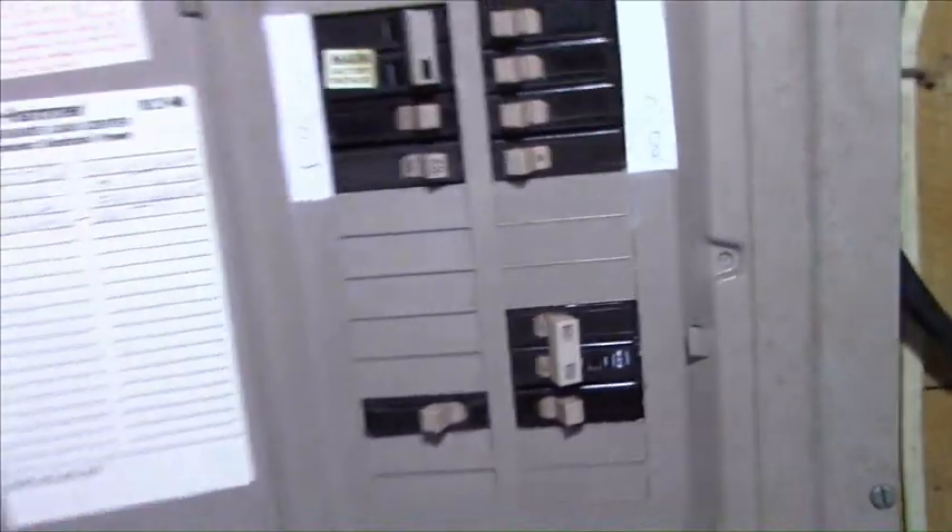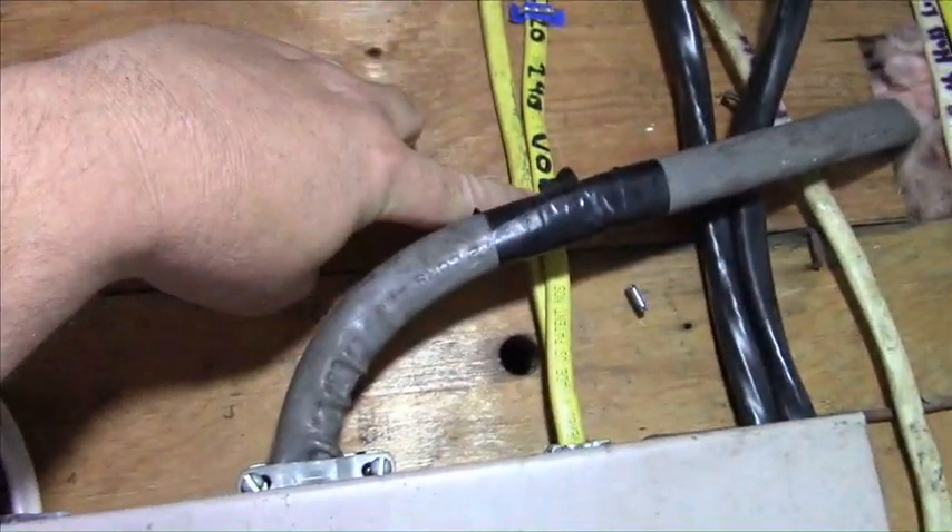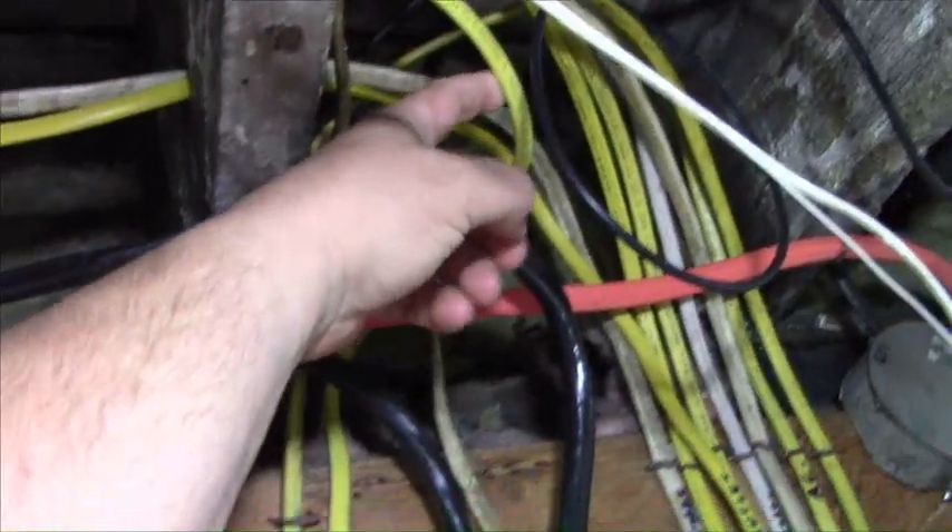Here's what I have in here. This is the Cutler Hammer CH panel. I have a 240 volt 20 amp breaker here, and it has its own wire that has been labeled '6-20 240 volt.' I ran this wire specifically for the 6-20 outlet. Along the way I marked it several times '6-20 240 volt' so it's not getting confused with other wires in the house. And again over here, as I put it in, '6-20 240 volt' comes through the basement and goes up and out to the outlet. That outlet is the only thing on this circuit.